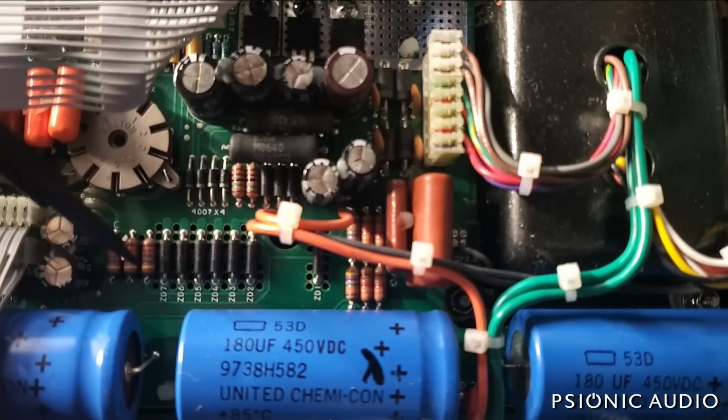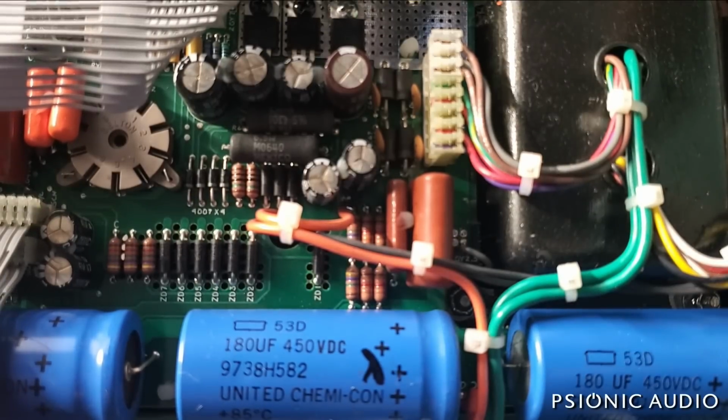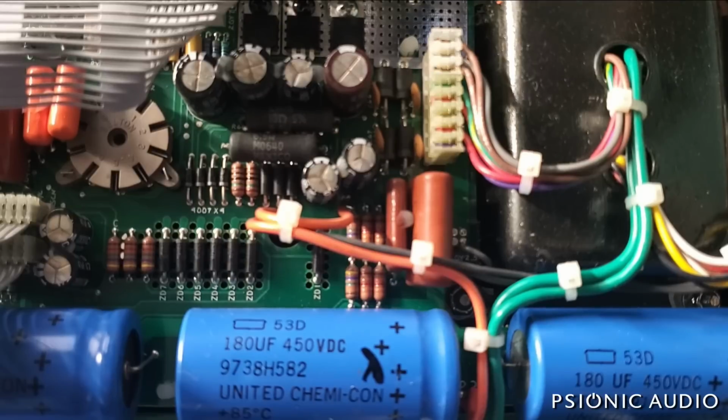But I've had many of this kind of resistor fail in a Mesa. These little 3/4 watt Vishays. I don't use them in my own stuff because I've had too many failures with them. They like to fail in Mesas. They like to fail as plates and high value cathodes, especially in following stages. So R60 and R59 are possible points of failure.